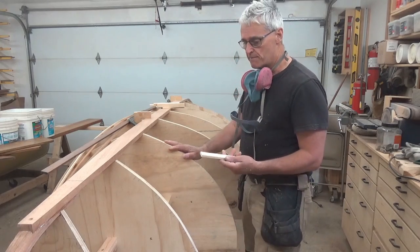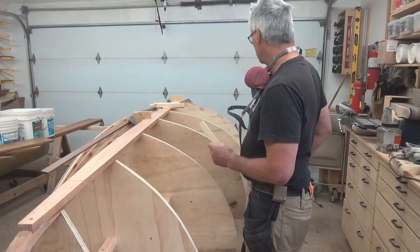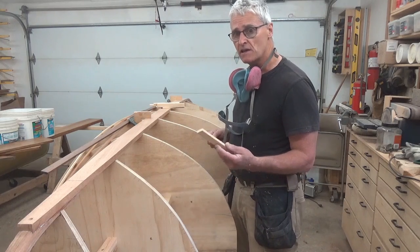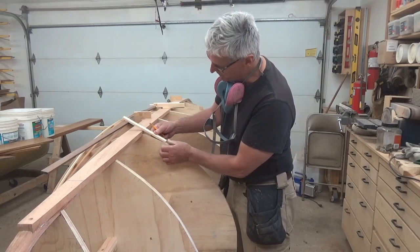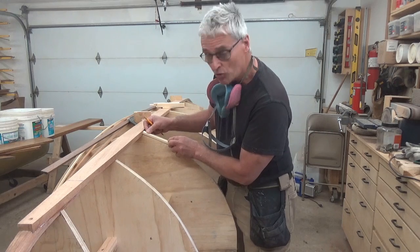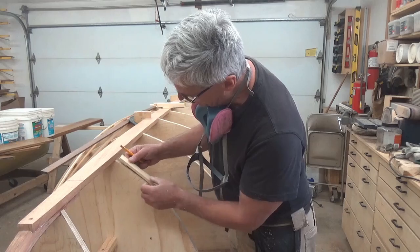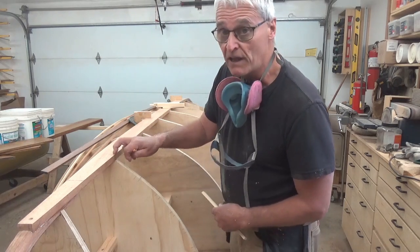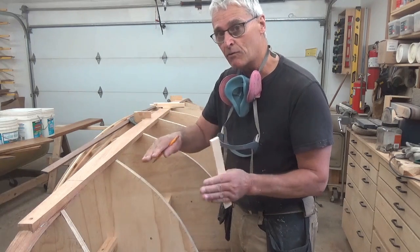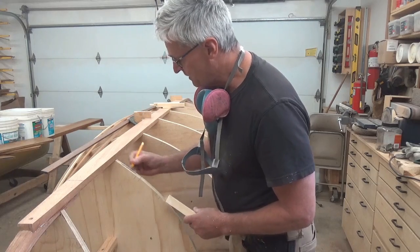Some areas of the hull form may not allow the planking to go straight across — I may have to shape flat areas on some of the molds, more than likely in the sharper curves. I have a sample bit of planking here, just a scrap piece of yellow cedar at the required thickness. If I lay it from where the plank would land onto the hog, I'm feeling if there's any roll where I might need to shave off a little. And look at this one — there's even more roll in there. For the plank to land from this point up onto the flat surface on top of the hog, I'm going to need to shave away some of the actual form. I'm not asking the planking to curve around the forms, certainly curve from end to end, but not curve around the forms. So we'll need to shave off this area here to flatten it out.